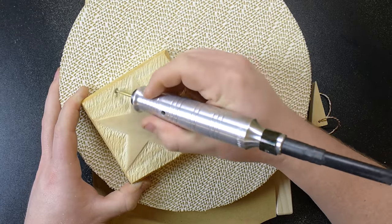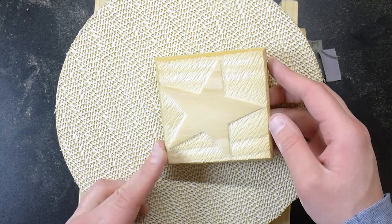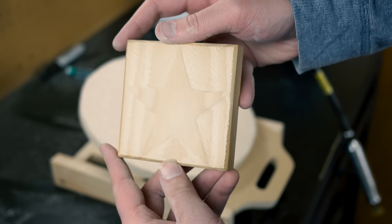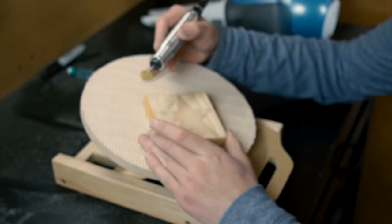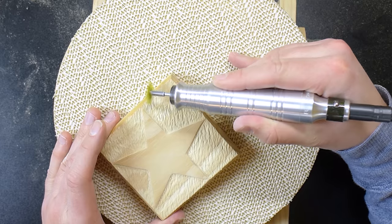I'm taking a small break here and letting my cameraman finish the texture — he's pretty good at power carving too. We just finished up the texture and it looks amazing. I really love the background. The next thing we want to do is take this little flat brush and run it in between the grooves at a very low speed, around a thousand RPM — this helps clean up everything.